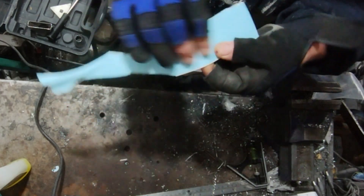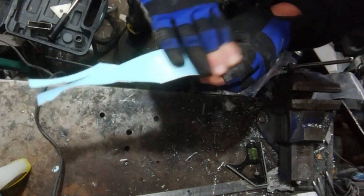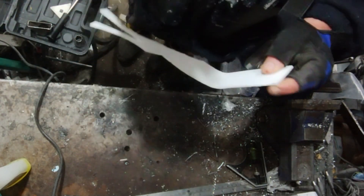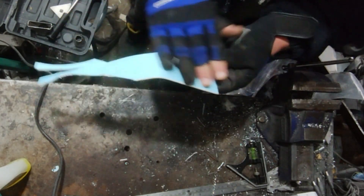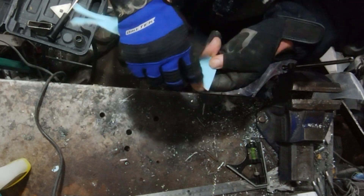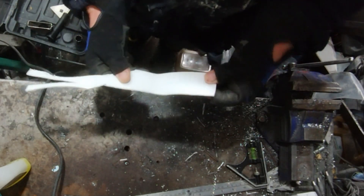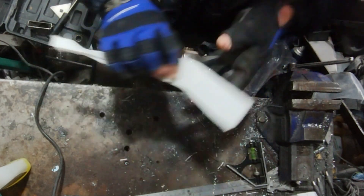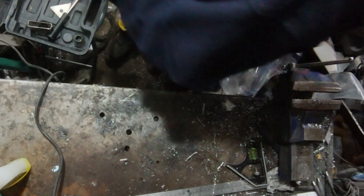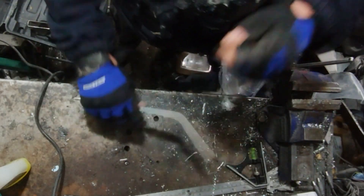That's good. This blue is just a protective layer — I want to leave it on there as long as possible. The idea with this is that one of the last stages of the car, I will peel the blue stuff off and put wrap over. So that's looking all right. That means I can apply a bit of heat in situ, get it to shape, and then use a little bit of GRP to strengthen the bits I want to. Hey, so that's the front on now.